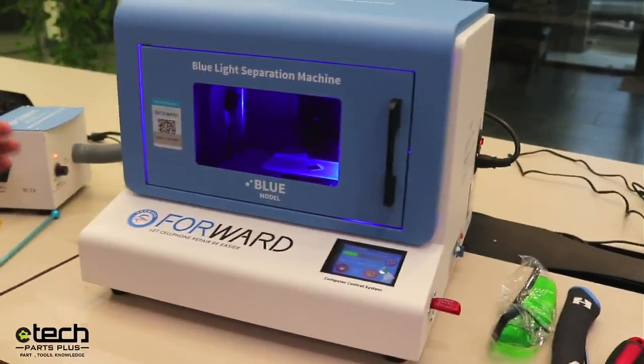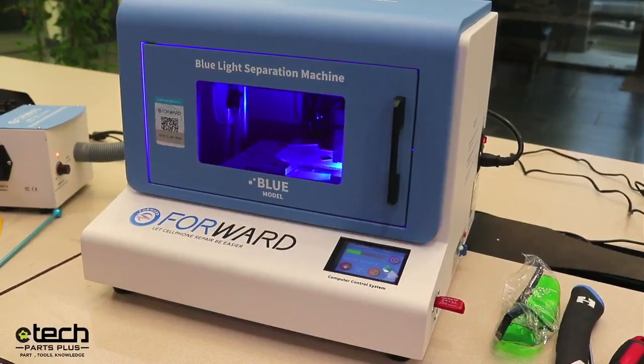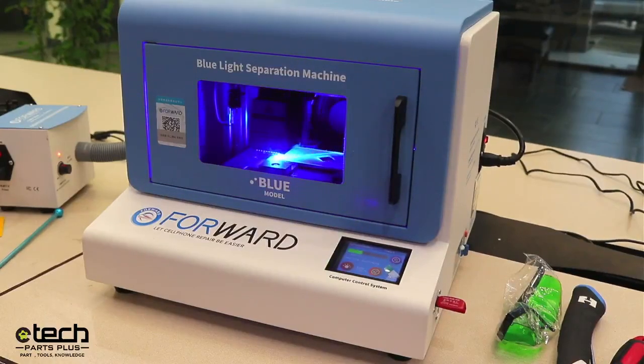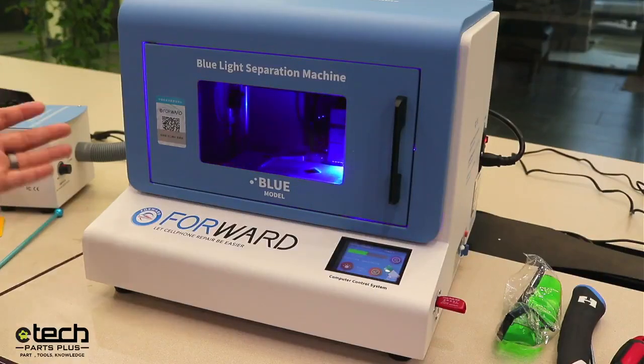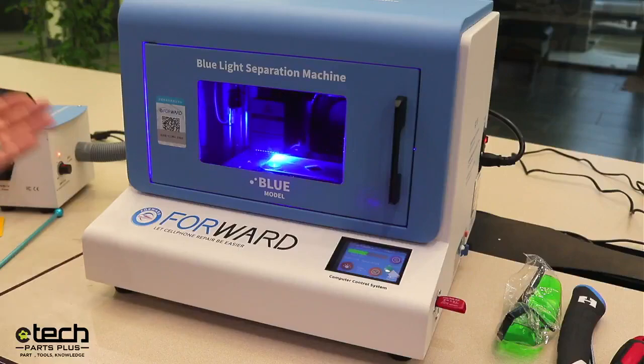What you're looking for is that the burn mark is even all the way around and around the center of the diamond. That means when you run a template, it's going to mark exactly where it's supposed to. If you don't complete this process and it doesn't mark correctly on the calibration glass, the machine is only marking where it's programmed — if not calibrated right, you're telling it to mark in an incorrect spot.